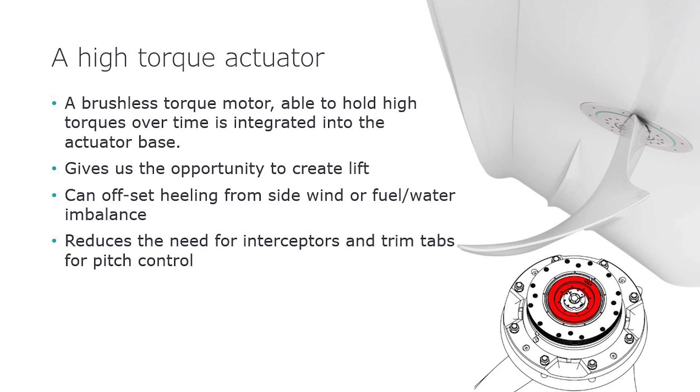Conventional flat fins can't offer this speed saving feature and thus necessarily reduce boat speed and increase fuel consumption. In order to hold the fins at an angle to the water flow and thus achieve the desired lift, Sleipner incorporates the high torque motor and a clever, reliable strain wave gearbox. The Harmonic Drive Company has a video that can show you more about this remarkable device — you can find a link to this video in the description below.